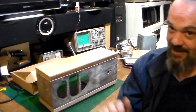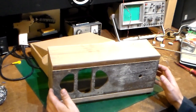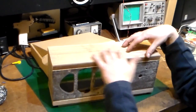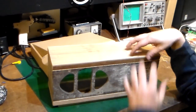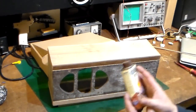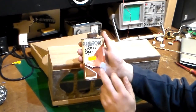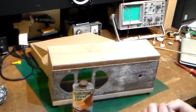The first thing we need to do is darken down this new veneer. When these were originally made, the lacquer they used had a pigment in it which darkened down the colour. The lacquer I'm using nowadays is just a clear lacquer, so we need to darken the wood first before applying it. What I'm going to use is Indian rosewood wood dye — I've had this for years and I'm getting to the end of it now.